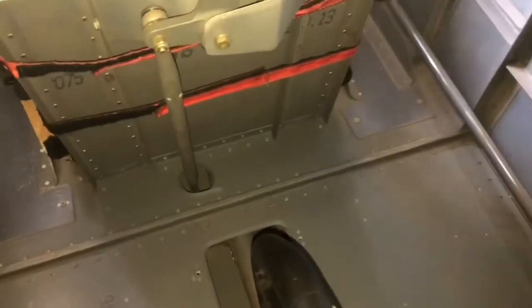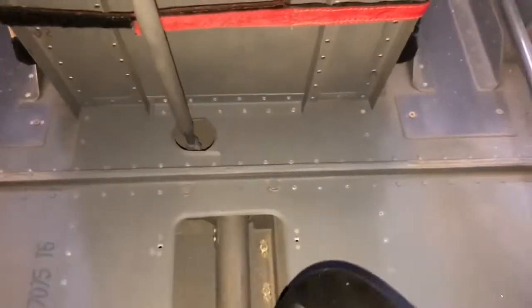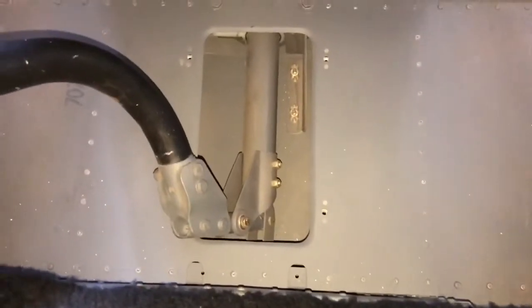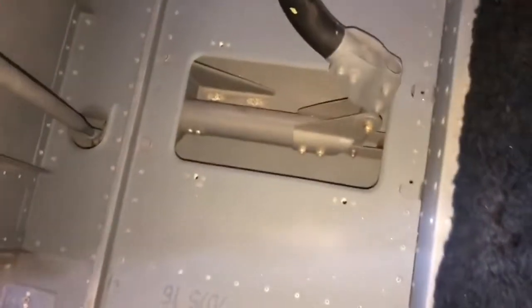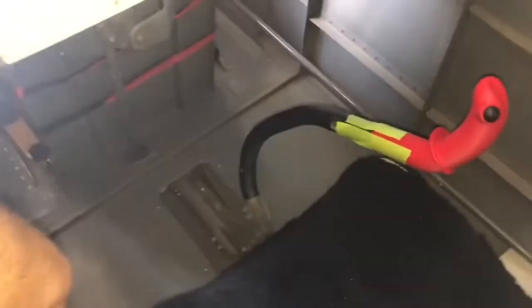I got into the floor — this is the pilot's compartment. Finished the aileron bell crank where the push-rod tube goes through, with a little panel. So that's all in now, and this panel's in as well. I've got to teach myself how to sew and make a bit of a boot over that one, probably over that one too. There'll obviously be another one here and one on the front cockpit when I get around to that.